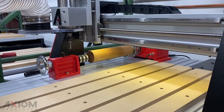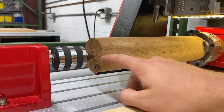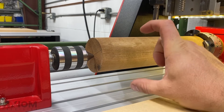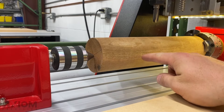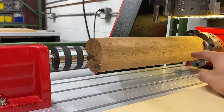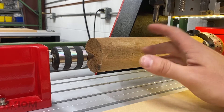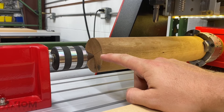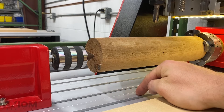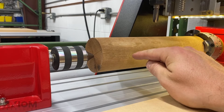So here's the question — why is the offset 75 millimeters? From the top of the table to your center spur equals 75 millimeters. If you remember, in our software we set our Z zero to the center of our stock. This is going to give us the most consistency on our Z axis, ensuring everything is going to be the same. That's why we use the center spur. So we set our Z zero at the top of our table, then we raise it to 75 millimeters, zero out again, and we use that.